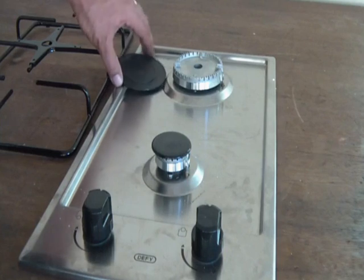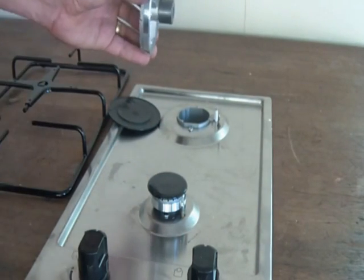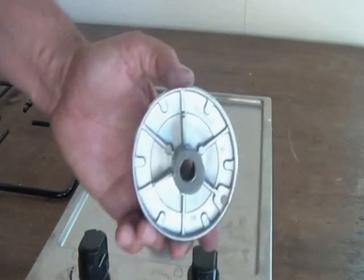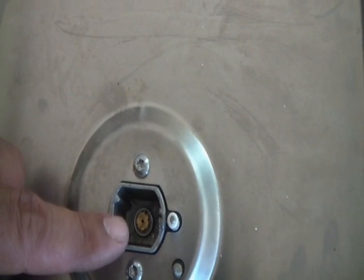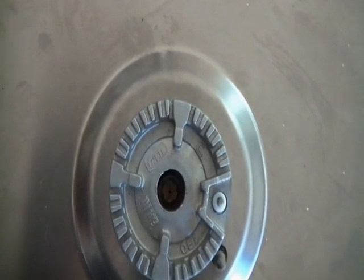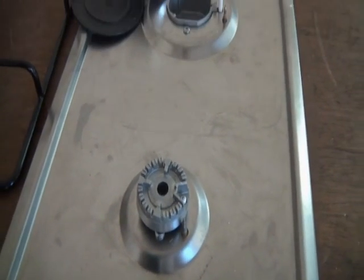The other nozzle has exactly the same conversion. If you look at that top piece, we've done the same little brass pipe to cut off the airflow — you can see it goes around so the airflow goes straight through into the nozzle. We've also changed this nozzle: it's now a one-millimeter hole size natural gas nozzle, not the LPG half-millimeter size anymore. Inserting that little pipe seals off the whole passage so you get clean, pure biogas through, enabling successful cooking.